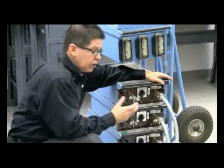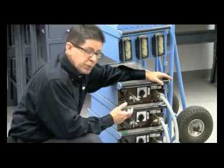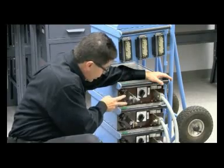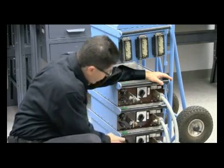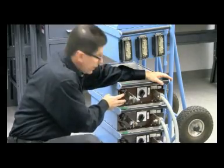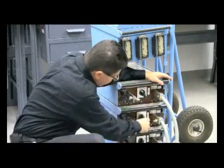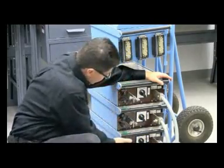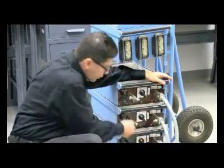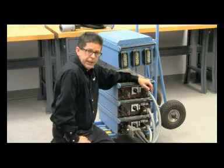For example, testing a Cooper V4H recloser might require 120-volt compliance voltage to operate. In that case you would need to operate out of the side stabs — the X version adapters for low current — and select between 0 to 30 volts or 0 to 60 volts. When you add these up in series, you get the compliance voltage that you need.